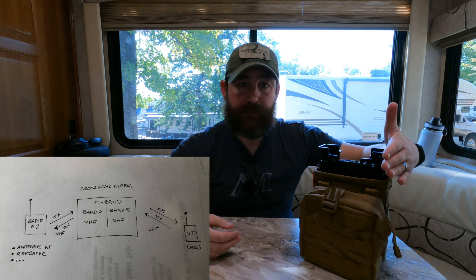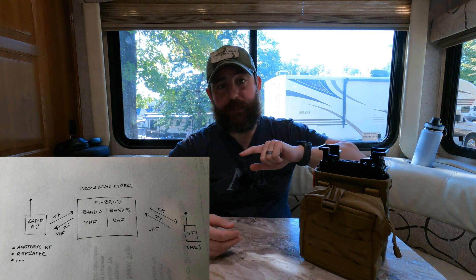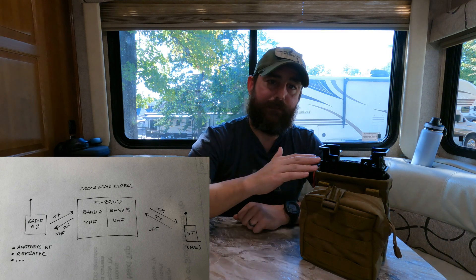So let's get into this idea of this manpack being a poor man's repeater. It has a capability because of the dual VFO setup called crossband repeat. All that is is a fancy way of saying you can use one of the radios to listen on one band and retransmit it on the other band and vice versa. So the way that works is you would typically transmit from your HT on UHF to the side, and then it'll retransmit on VHF — the opposite band — and then vice versa. If an incoming signal on VHF comes in, it'll retransmit it on UHF back to my handheld. There are some FCC issues with that, but in general it has never been a problem.